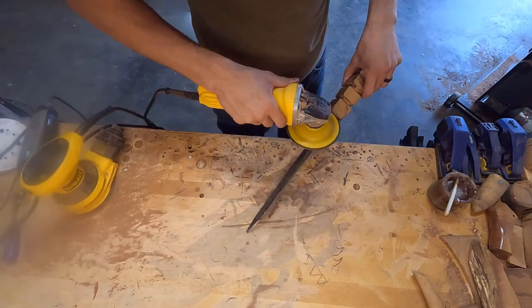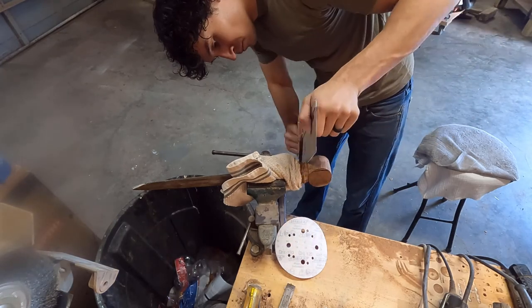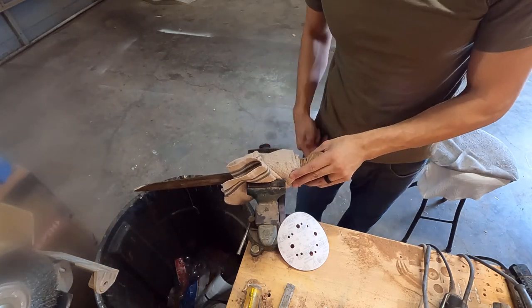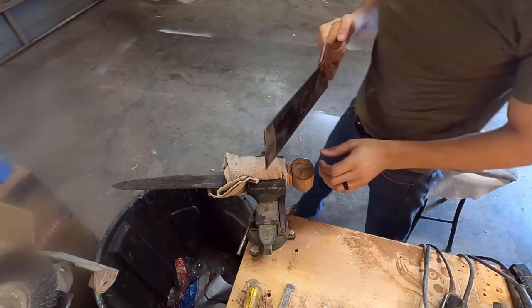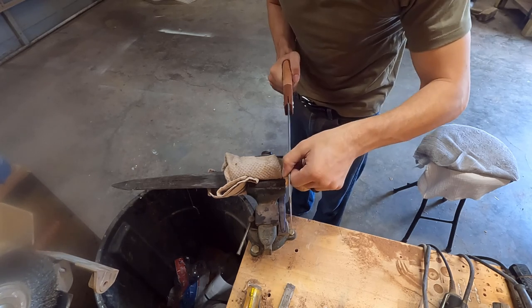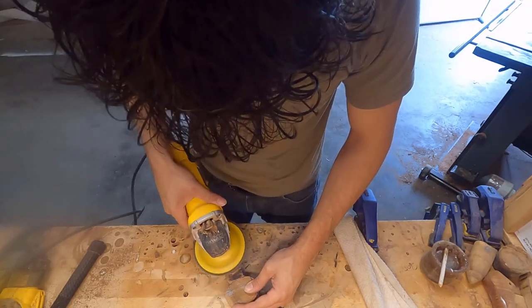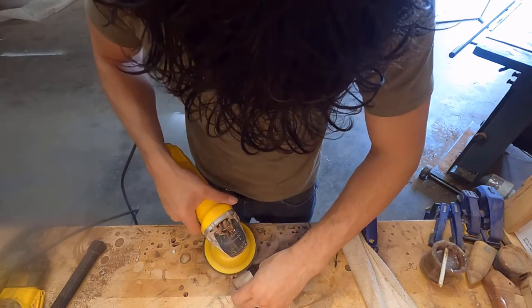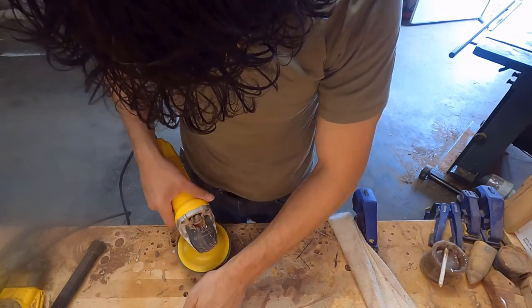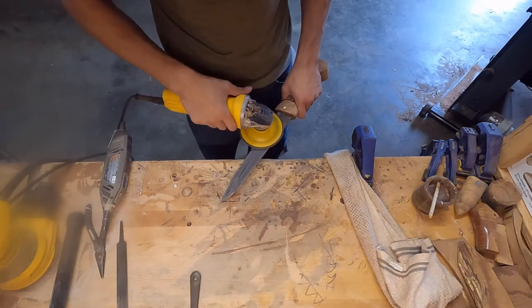Because the bill is already solidly epoxied in, I only let the peg sit for about an hour, then came back and started immediately shaping. I needed to bring down the handle material quite a bit — it was going really slow with my chisels because it's a harder, denser koa wood. With the file it was also slow because it's a finer grit. So I grabbed my joining saw, used it to cut in those edges, then took my angle grinder and very carefully ground up to where I cut, giving me a very clean edge between the pommel section and the handle section. That worked out really well. Now that I have it mostly shaped, I can start working on the blade.